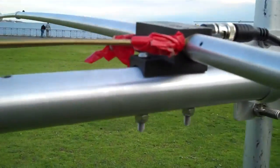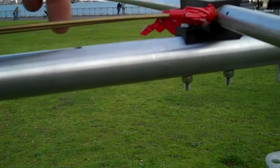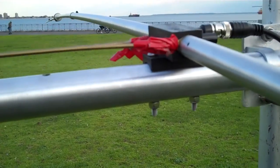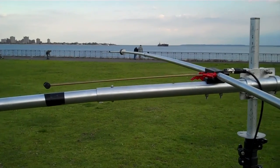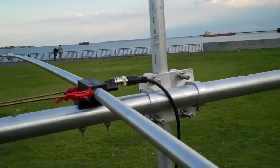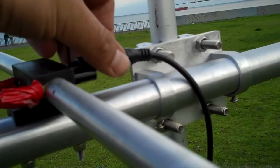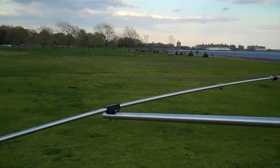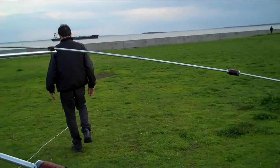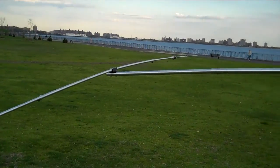Here is the antenna. The driven element is the middle element and these two constructions are going through that connector. This is the 20 meter tuner, which when extended all the way out is mostly to the right length. Here is the cable that will be bringing in the power with a little bit of strain relief. This is how it gets connected with this connector here. So here again is the 20 meter setup and we are just about to bring it up to about 16 feet height on this tripod.